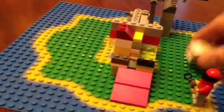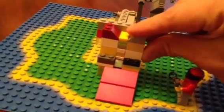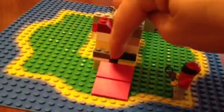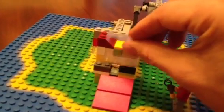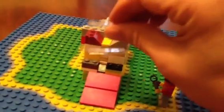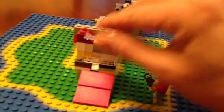Hopefully this demo will work too, but it doesn't always. You'll notice if this little stack here gets — if this part is just bent over too far — that'll bind and then they won't pay out just perfect. That's your challenge when you build a Lego automated piece of equipment. Even this cover plate: it's necessary to have it, and I have to have it at just the right height to hold the second piece back. But if it's down too far, once in a while it'll bind on the one that's ready to come out next — and then disaster.